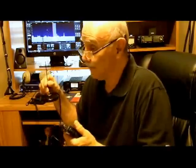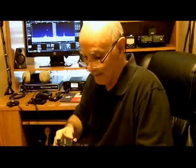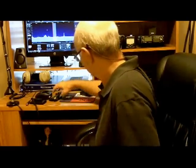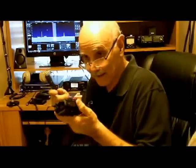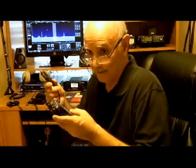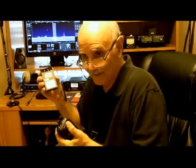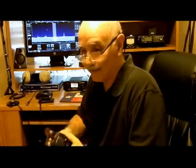You're not going to get much of a signal if you try to transmit inside a car — it's surrounded by metal everywhere. It's a much better signal if you put the antenna on the roof and run the wire through the window. So if I have this rigged up with the cigarette lighter adapter, I basically have a mobile rig — a dual band rig at 5 watts that works off the cigarette lighter in the car indefinitely. You should always have a battery fully charged to walk around with in case you're at an event out on the street.